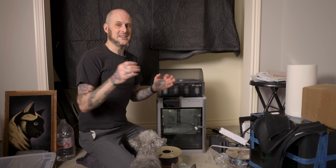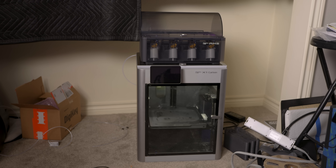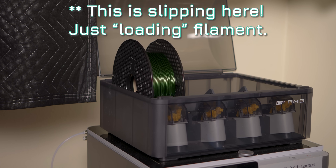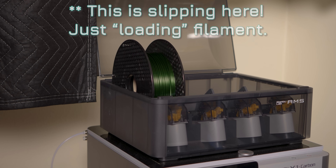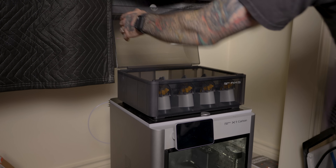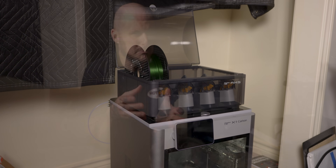It just takes so much longer to retract filament all the way back to the AMS, and that's not accounting for issues. The slicer estimate for the X1 was only seven hours slower versus what we got out of the XL on this print, but I have personally never found that slicer estimates with the AMS are accurate at all. Any little bit of slippage on those rollers — whether a cardboard spool or a plastic spool — is not accounted for and slows down how it feeds filament in and out. And that's really not accounting for when it just can't do it at all and you have to intervene to save the print. I swear the AMS has gotten worse over time — my previous one I completely rebuilt and it still wasn't feeding properly. I picked up this unit from a follower who had barely used it, and this one too has problems. It seems like they don't really break in, they break down.